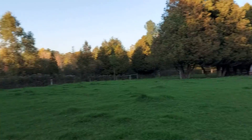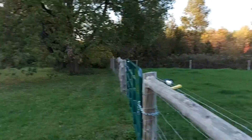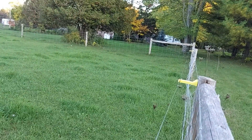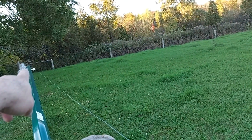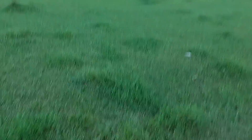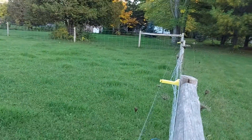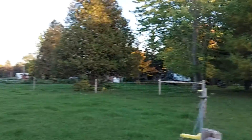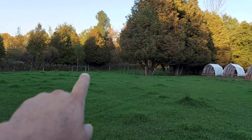We're right by the road and you can see the wire comes across from the other side, hooked up at this gate, and it continues. This wire is spaced out — it's supposed to be spaced about five inches — we have these spacers here, and the corners all have these. There's no connection or fastening on the corners; it just loops through. So if you put a tensioner in line it'll tension the wire all the way around. It's a continuous wire — no crimps in the corners or anything — and it goes all the way around.